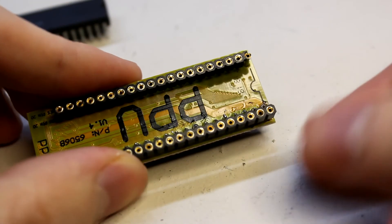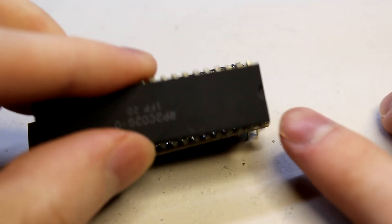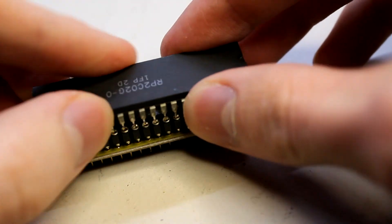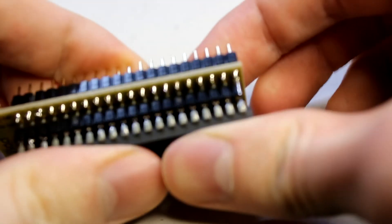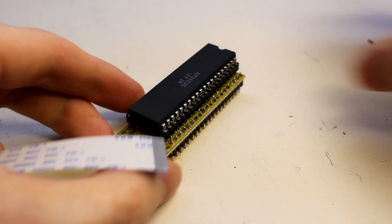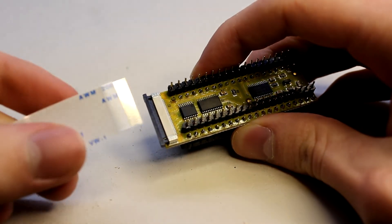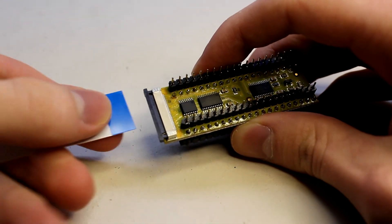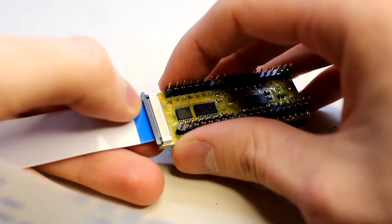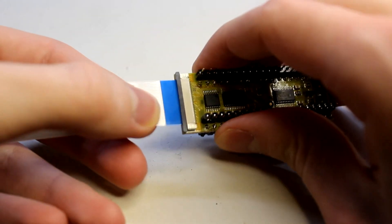You can see they've nicely labeled the notch so we know which way to align the CPU or PPU. I'm going ahead and plugging that in — make sure none of the pins are bent. You can see there's one bent right there; I did correct this later on. Now we're going to plug in the ribbon cable. The blue side should face the chips, or the male end that plugs into the NES. Slide that in, hold it gently, and close the clasp. These clasps feel a bit cheap and will almost definitely break if you're not gentle with them, so be careful.